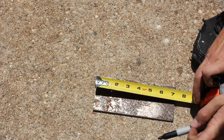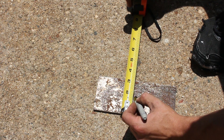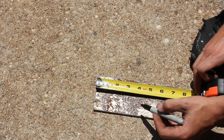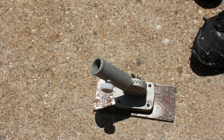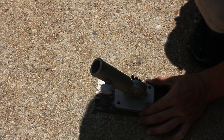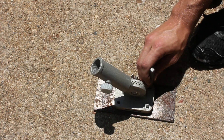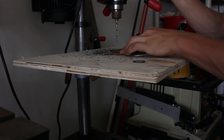Then I'm going to find center on the plate and measure the length of the flag mount and get that so it's almost centered. It doesn't have to be exact, but as long as it's not off by like an inch. Once I get the center marked and I'm happy with its location, I can mark the holes for the flagpole mount with either a small sharpie, or in my case a center punch since my sharpies would not fit down in the hole. After the center punch holes are made, you can see they leave a divot for the drill to be guided in.